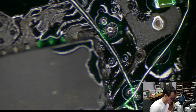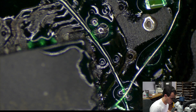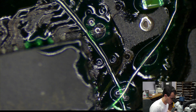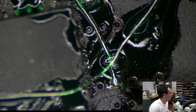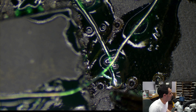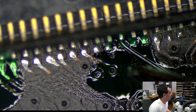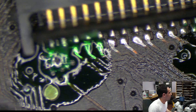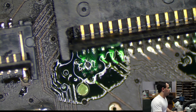Over here, same idea. I didn't solder directly to the pad of the chip — it's a QFN package. What I did is go right by a little probe point on the board, scraped away, put some solder on it, and went straight to the pin. I covered that in green, so it's not going to be loose and conductive and move off the board and cause me nightmares.